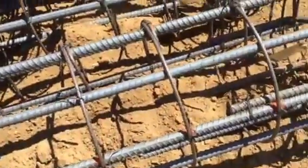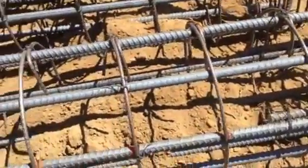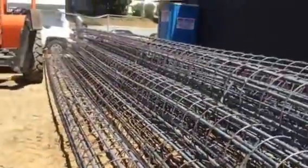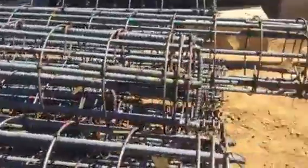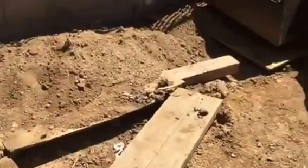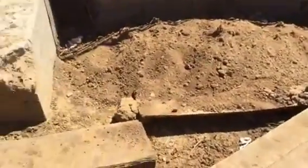So it's eight number six vertical bars, number three at nine inches on center, and they're approximately 50 feet in length. You cannot see it here, but here are the reinforcement cages — they're covered with plywood and soil just to protect from people falling in.